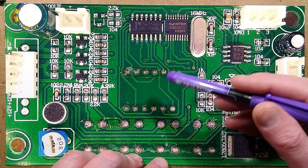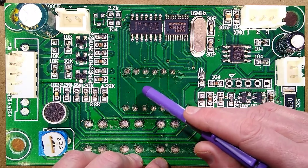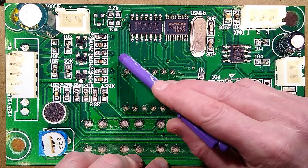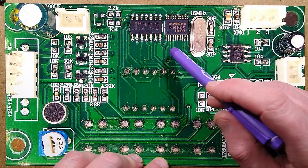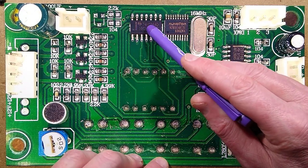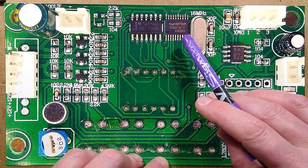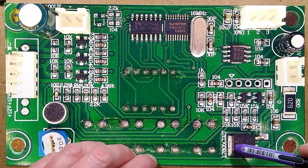And then it goes on to the next digit, which might be 4, and it will move the data for 4 out and then switch that digit on. It's multiplexing, but also pin-saving multiplexing. It saves a lot of circuitry. It also relies on the impedance of the pins, the logic circuitry in here, to limit the current. There's no specific current-limiting resistors, which is slightly naughty.